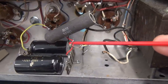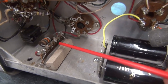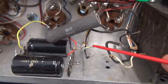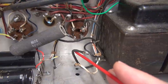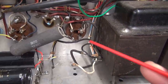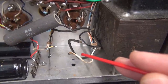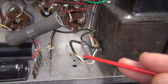First, we need to cover this wire right here - it's a white wire with a brown stripe. That was the high voltage that came off resistors R20 and R19. This was the voltage divider which produces the 200 volts - you are going to abandon that wire, it will not be used. The black one is ground. The white with yellow and blue is the key line. On this side we have two blacks - this heavy one is the primary of the high voltage transformer, and this one goes to your crystal socket on the back to power your TR switch. Those two will go together. The white with the blue stripe is the 120-volt AC feed - this will switch to those two lines. Finally, the white wire goes to pin 2 of the mic jack and also to your manual plate on/off switch on the front of the transmitter - we will reuse that as the keying pad to the K1 relay.